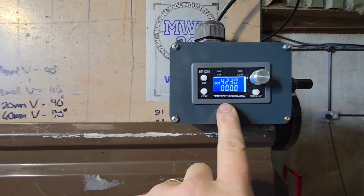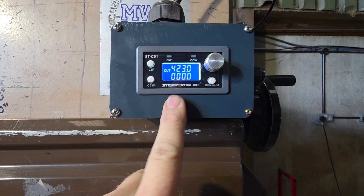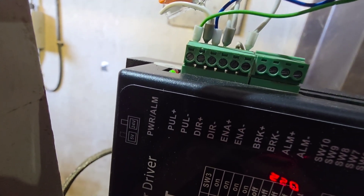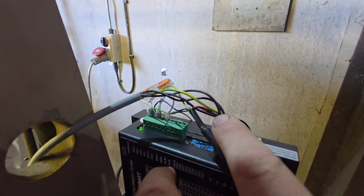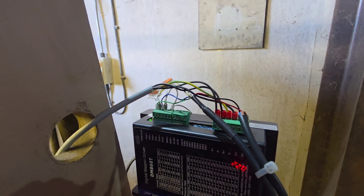Now, I don't know about you, but that is cool. You've got speed control on it, you've got all kinds of functions on it. It's just a brilliant piece of kit. You hook it into your stepper driver — hook it into your pulse, direction, enable. That's all you've got coming out of that thing. You hook up a little bit of power, and you connect your motors — A leg, B leg, so on and so forth. I tinkered with the switches a bit but it wasn't that important. So that's what I did — took us about three hours to sort it all out, rip out all the old and put in this new.